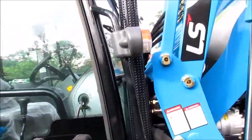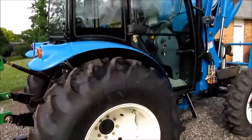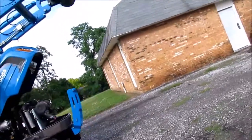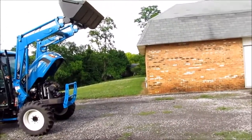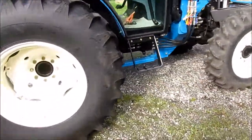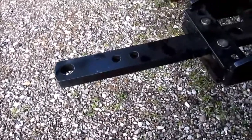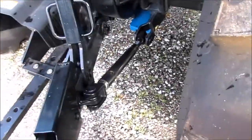This is a Shibaura four-cylinder turbo diesel — a great engine. There's not a time it will not start. You've got steps on both sides and doors you can open on both sides. I've had this tractor on some pretty steep hills and it will not flip over. That bucket lifts high enough in the air that I can load a full-sized tri-axle dump truck — and I have. You've got a big draw bar, I think it's a one-and-a-half inch, with multiple settings.